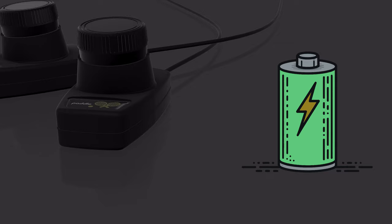Reading from the input 0 through input 3 registers will only tell us if the capacitor is charged or not. We need to determine how long it took the capacitor to charge. And despite what the Stella Programmer's Guide and countless other websites confidently tell you, the Atari 2600 console cannot tell us and does not know how long that took. Reading from the paddles and determining where to place your player graphic can be broken down into these four steps.